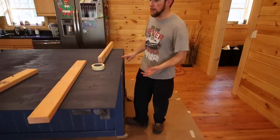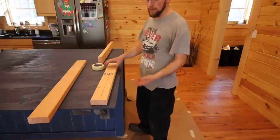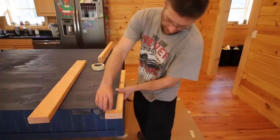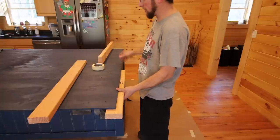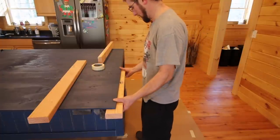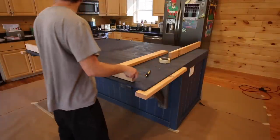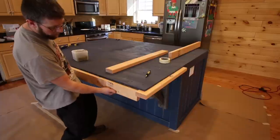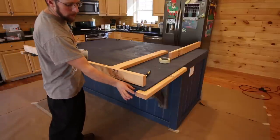This next part is going to be a little bit different for everybody. We're using roof drip edge to give us our corners. I'm making a support for the drip edge right now using two-by-fours, leaving an inch and a half overhang — that's what I'm going to have for the drip edge overhang, an inch and a half this way. We're going to put them in place and put the drip edge in place. I got my supports on either end of the overhang over the bar area. Now I'm going to mark the long section and mark where my floor joists are so I can notch out this two-by-four to slip it in with only an inch and a half sticking out.